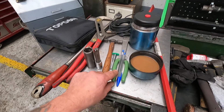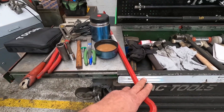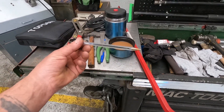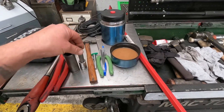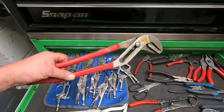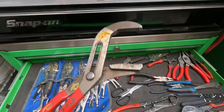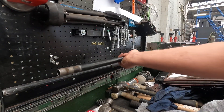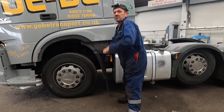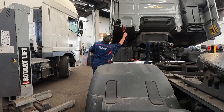I'm going to give you a little guide into what I use for servicing — some tools, which includes coffee. We have hammers and the bar for pry barring, a few other bits and pieces, and of course the pen — that is mightier than any spanner or any sword. With DAFs, that's for the rear diff — that's T70 and an M22 socket. These are water pump pliers, which I don't know why they're called that — never used them on water pumps ever. They do open to quite a large aperture. We've also got the cab bar for jacking up the cabs. You've got to go under the cab to do your checks.